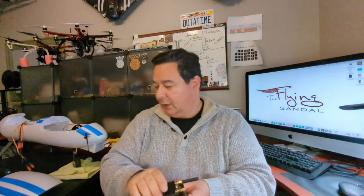Okay? Alright, well there you go. Hopefully you like this video, you learned something. Like I said, I don't think this topic about how to power your electronics is covered well enough, but splitting the servo rail, powering it separately from the flight controller and from the other electronics, providing enough power to those components that draw a good amount of power, those are some of the critical ideas.